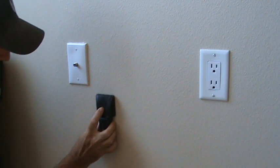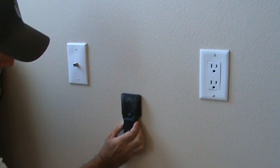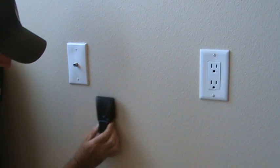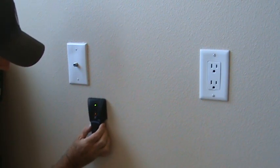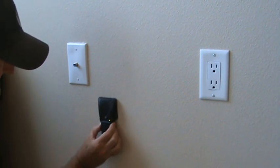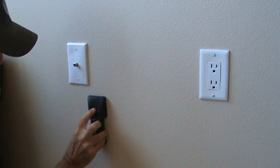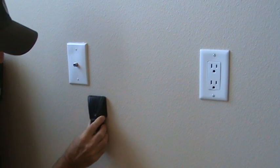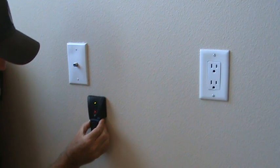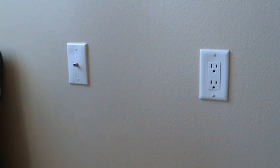Sometimes when you put this on the wall, you may have to clear it — push the button a couple times and then start sliding it. Now I know I'm starting to hit something because it's red and then it comes up. Usually the red light flashes red, red, red, then green — but this one's not doing that this time. I know there's a stud probably right there.